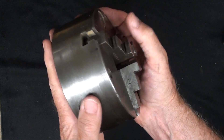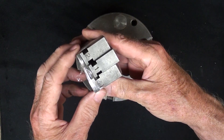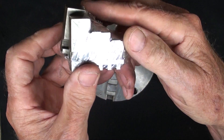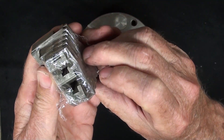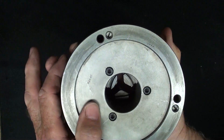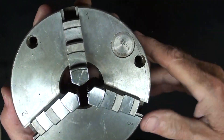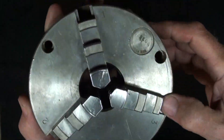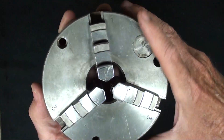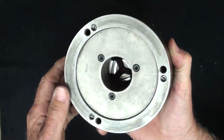These jaws are one-piece jaws, and if you want to reverse them — and I told you they're missing — you would install another set of jaws like this. Remember that the jaws are numbered 1, 2, 3, and they always have a serial number on them someplace. That serial number has to match the serial number that is on the chuck. Also notice that the slots here are numbered 1, 2, and 3, and you must install the jaws in the correct order.